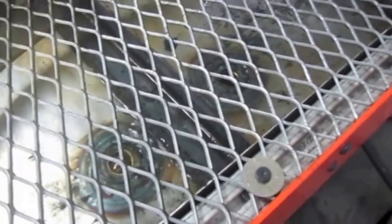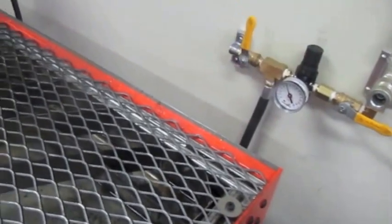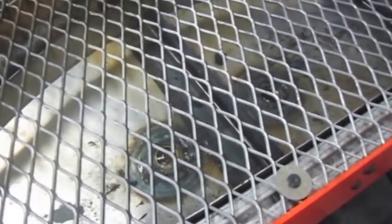One of the things I'm going to add is a baffle on top here so the water doesn't splash up as it first starts pressurizing. When you're draining it you just reverse the process — turn off the incoming pressure, turn on the vent, and the water starts draining out again into the tanks.